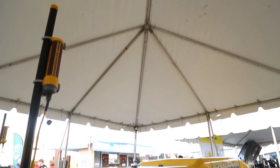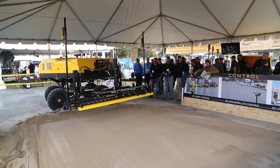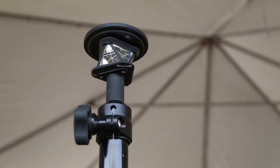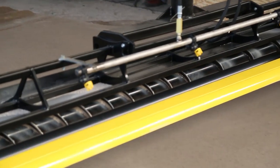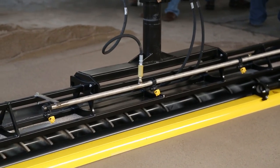Tell me about the 3D technology you can equip all your machines with. Over the course of the last three years, we've combined engineering resources with Topcon Solutions, the world leader in 3D technology, and we've been able to incorporate their 3D millimeter GPS system — a satellite-controlled machine control — into all of our machines. This year at World of Concrete, we also introduced their LPS 3D system, which is a robotic-controlled system. It's a lower-cost system and a little bit easier to get into than the GPS system. The GPS advantage is you can have one 3D system running every machine on the entire job site — dozers, curbers, screed machines. We've incorporated that technology into all three of our machines, and it's something a customer can upgrade to at any point in time.